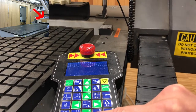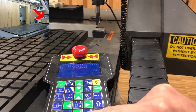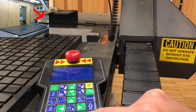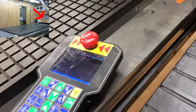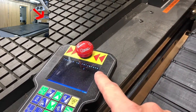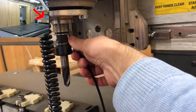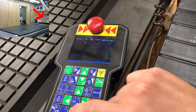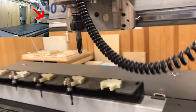As it descends, this is your last chance to visually check that the magnet is still in place. If the magnet is not in place, it will collide with the plate; if it is properly in place, it will be properly calibrated. After calibration, don't immediately select the next tool — first remove the magnet. Having calibrated tool number 1 and removed the magnet, press 2 to select the next tool to calibrate, then press enter to confirm. It will leave tool 1 in tool holder 1.